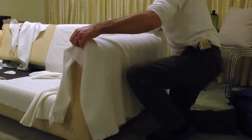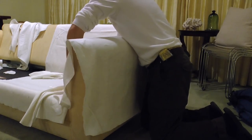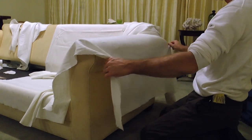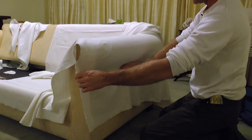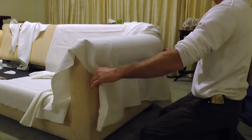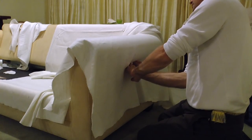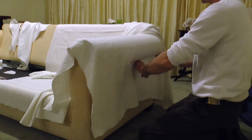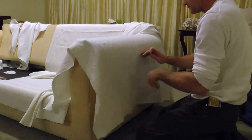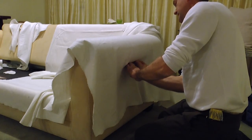Try to keep it as straight as you can. The end right here, leave yourself maybe 3 inches or something. Just always try to give yourself as much as you can afford. Cutting it tight just ends up making your job a lot harder. Now remember, I wanted to bring my skirt up to about 10 inches, so we've got plenty of room here. 9 or 10 inches I'm going to do on the skirt. Put an anchor pin in the center there. Just like that, and roll off to the edges or to the sides.